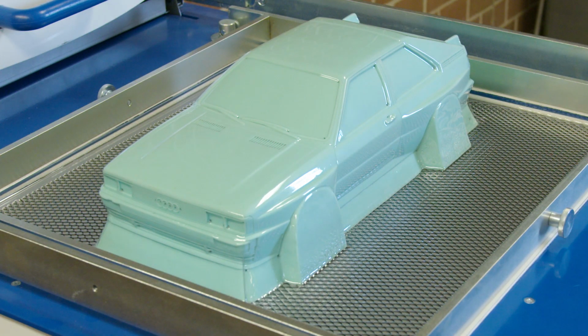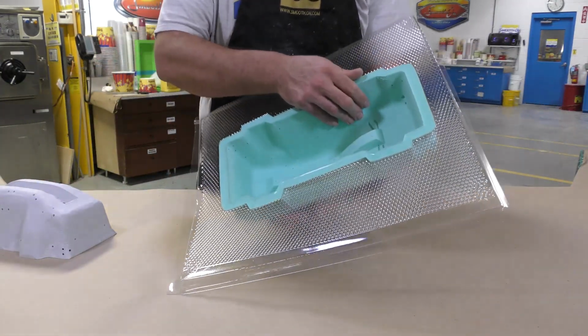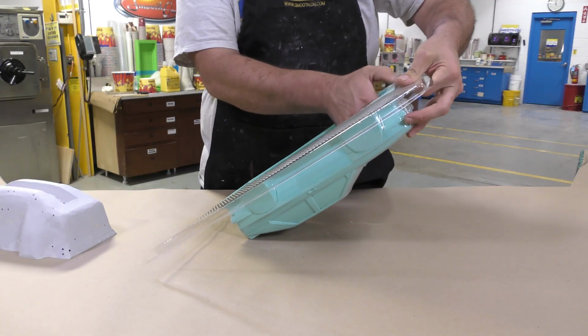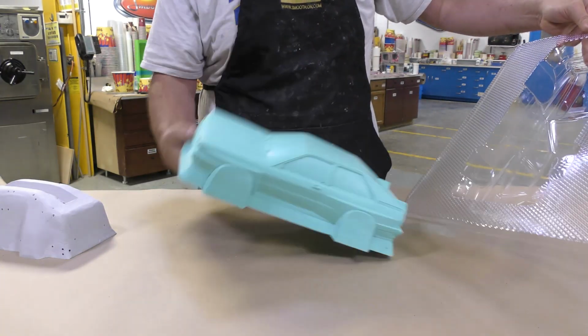The freshly vacuum formed material is allowed a moment to cool down before being removed from the vacuum form machine. And here you can see that by first removing the core that's rigid, we're now able to remove the silicone skin out of our vacuum formed object much easier without destroying the vacuum form object that we just created.